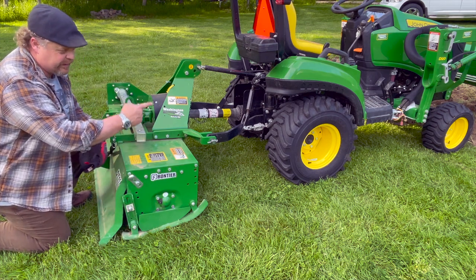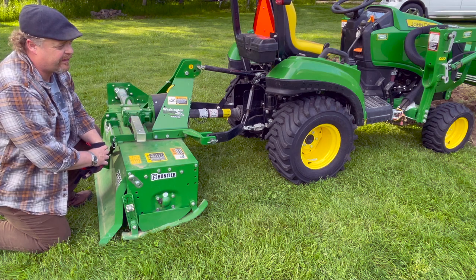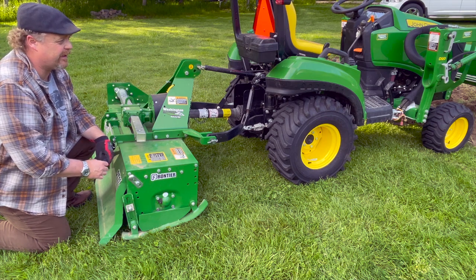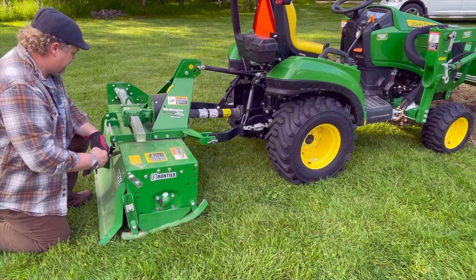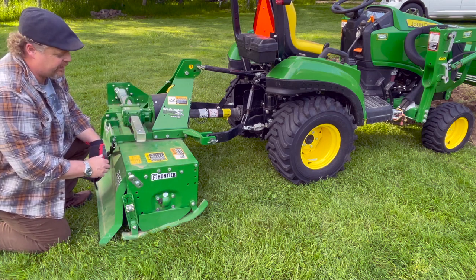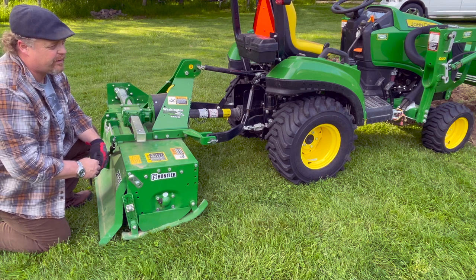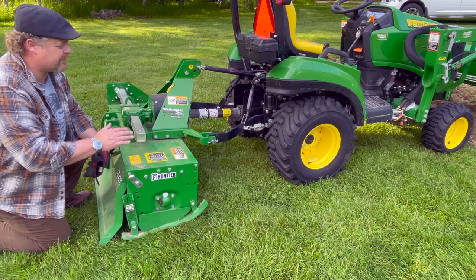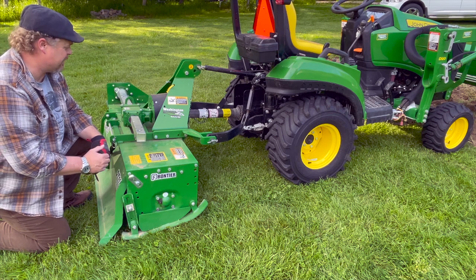So all I'm gonna try to do is bring up that mulch or that topsoil that we got and turn that up, and I wanna just get that as flat as possible. Then it's easy to maintain or to adjust, I guess, once that is all churned up and tilled, and then that dirt will be nice and soft. So we'll probably only have 3 inches of depth, maybe 4 inches at the most. And then that gives me a better chance to level out all the stone. We'll put the weed guard down and we'll go from there.